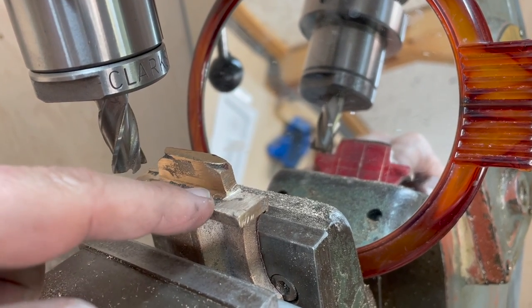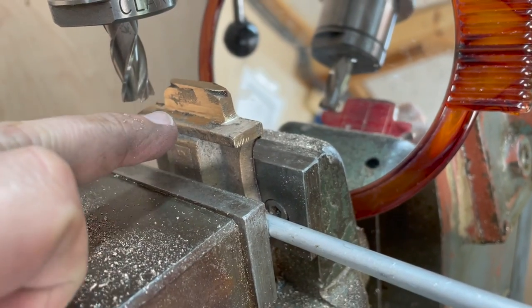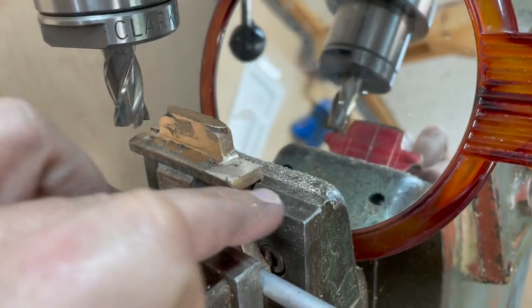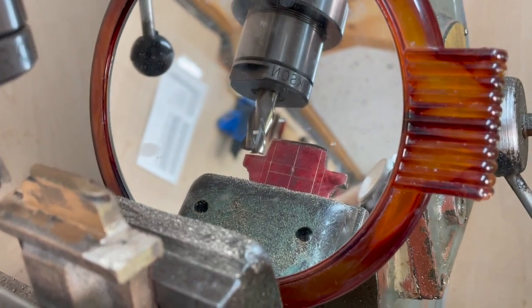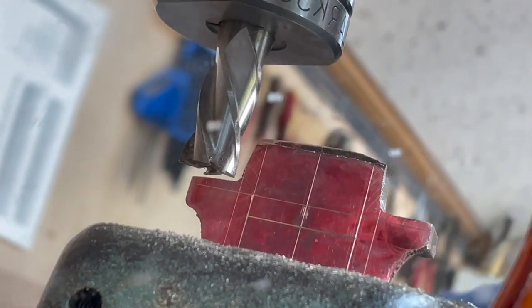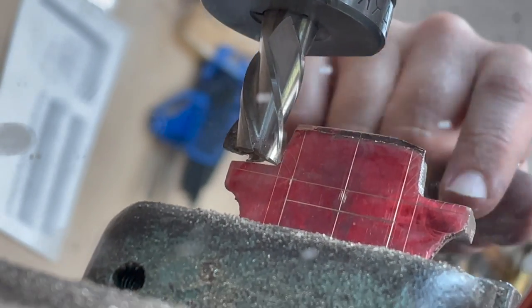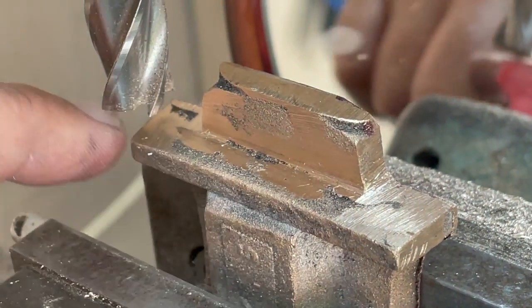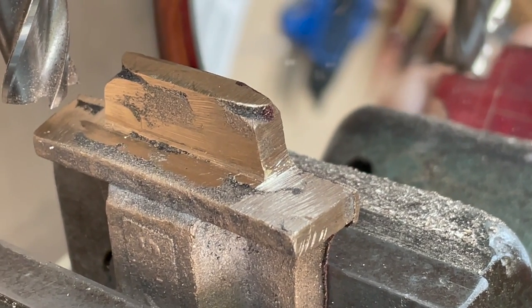I think I'm going to do it this way around, which is to grip it here — I've got an aluminium bar in there so I'm holding a new flat face up against the fixed jaw. I'm using a mirror to work out where on that flat face I'm going to be moving the cutter to, and try and mill up to the lines on that. Then I'll be able to put a parallel on top of this face when I flip it upside down and get the other side parallel to this one. I think that's the idea.